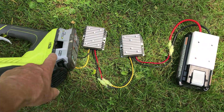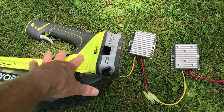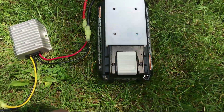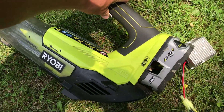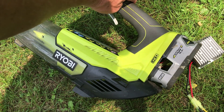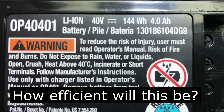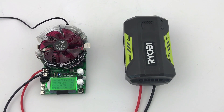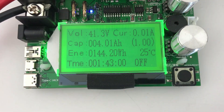It's not very pretty, but I want to test to see if this works. I've got an old battery carcass that I'm using to connect to the 18-volt tool, and I have two DC to DC converters driven by a 40-volt battery. It seems like it works okay. With this setup we're just going to see how many watt-hours are in the battery. With the 4-amp hour Ryobi battery rated at 144 watt-hours, I rated it at about 95 watts and it actually got 144 watt-hours.